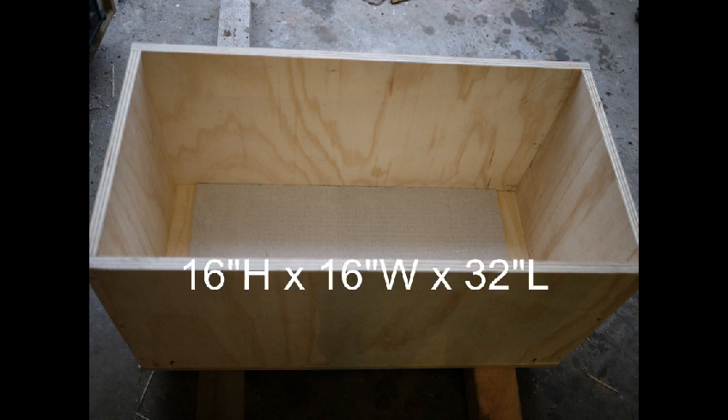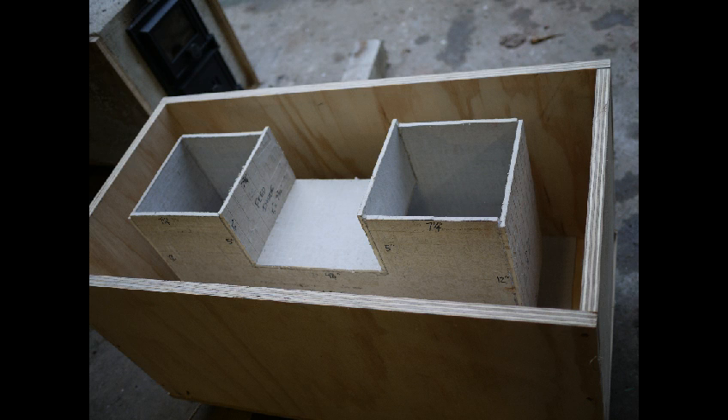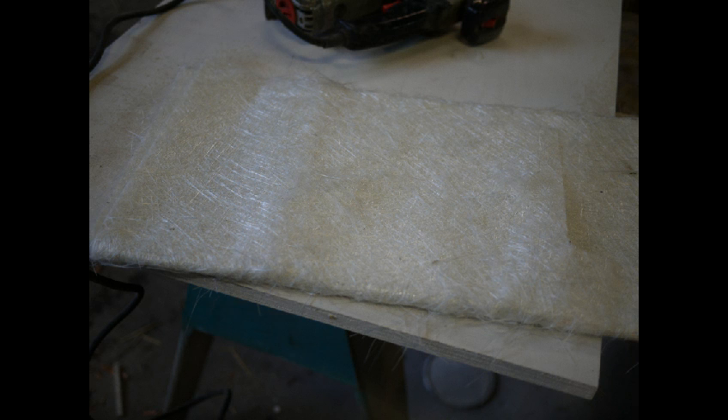Then you want to build a box — this should be, in this case, 16 inches by 16 by 32. I put a piece of hardy board in the bottom and I screw the bottom and the sides together from the sides with a diagonal screw, toenailed in. That's because you're not going to want to tip this thing upside down to unscrew the sides later on. It's spaced up on a 4x4 right now just so I can make sure the fit is good. We've got 4 inches of insulation basically all around, so I mark a 4 inch line on the inside and I fill that up with the material and then place it on top.